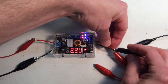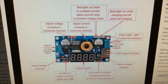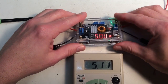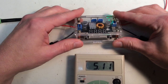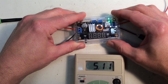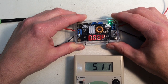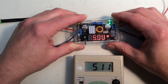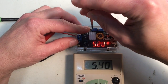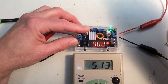I like this — it does have short circuit protection. If you end up short circuiting the output, it will shut down. This is another quick overview of the controls, available on their website. I do have an external digital voltmeter hooked up here right now, and you can see there is a slight difference between the readings. So basically what this module will do is convert a higher level DC voltage on the input to a lower voltage on the output — whatever you happen to need. I'm going to set it to 5 volts output using my 13.8 volt power supply on the input. There we go.